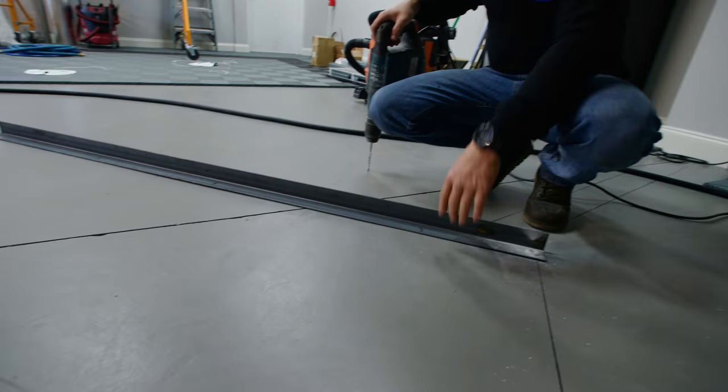Next thing is to clean up the corners, the inside corners of all the cuts. I'm gonna chip out where the lines are gonna go to the control. There's like a drywall column there that Matt wants to put the control in front of. So I gotta finish chipping that out, because we're not going full depth on that because there's a big footing there. We're just gonna chip away a little bit, just to make enough room for the lines.